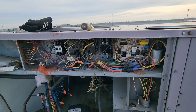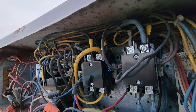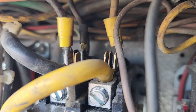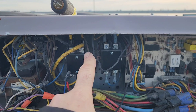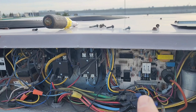I'm not sure how the snow is getting in. If anybody has any tips on how to rectify the situation I'd love to hear about it. The reason the fuses are blowing constantly is because we have an issue with one of the contactors. You can see that terminal there — how it's burnt, how it's kind of melted. What happens is the snow gets in, and if there's any dust or carbon, and it gets damp, the power tracks across or it tracks back to the cabinet plate which is ground, and the fuses blow. This is very common and a lot of people don't catch it. All you have to do is inspect the line side of the contactors and look for that melting.